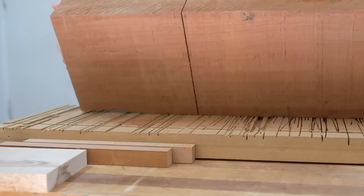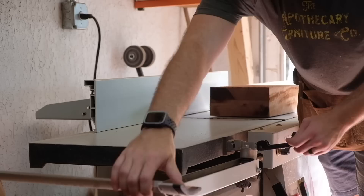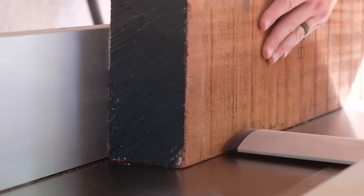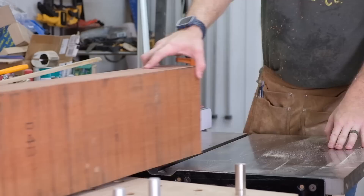Let's set the cabinet aside and move on to the 80 drawers. This 16-quarter chunk of mahogany is left over from my mahogany apothecary cabinet I made earlier this year. It's a quarter-sawn piece with a nice ribbon grain, and there was just enough left to do a grain match down the 10 rows of drawers. I began by milling a face and edge at the jointer and then took it to the table saw to begin re-sawing. I like this approach because it causes less stress at the bandsaw — less stress for me but also on the tool — and gives more accurate results. I had the material to spare as far as the table saw blade kerf is concerned, so getting these five panels wasn't an issue.